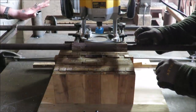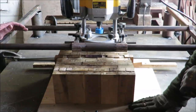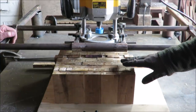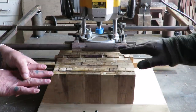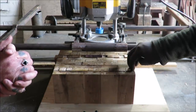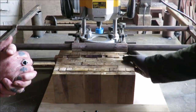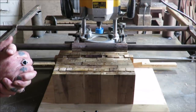Right then, Ollie — the moment of truth. We've got this tight in the frame now at the bottom. What you didn't see is we've referenced this bottom face against the top. We can't just rely on all these surfaces to be level — it's important to get that right first. If you're doing this at home and making jigs, get that face referenced first; don't just assume your bench is level. You can see it's a few mil out either end. As we push the router back and forward, we're going to tear out the back edge here, which is why we don't trim this up at this stage.